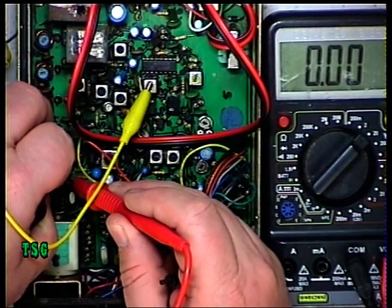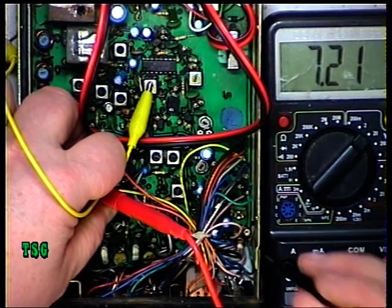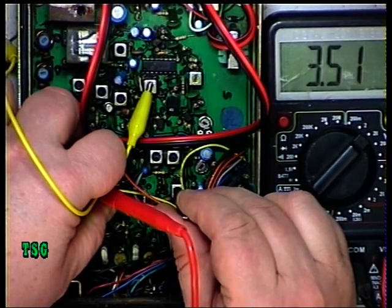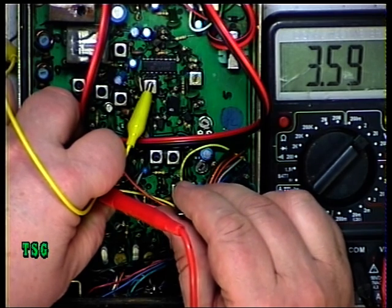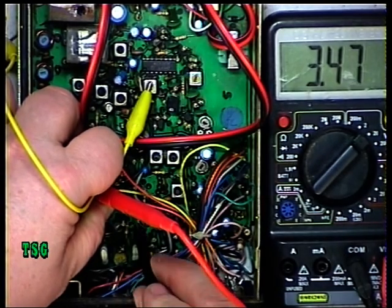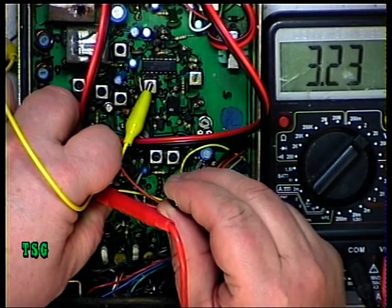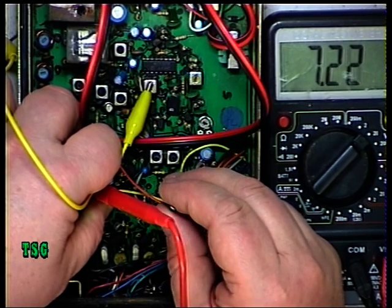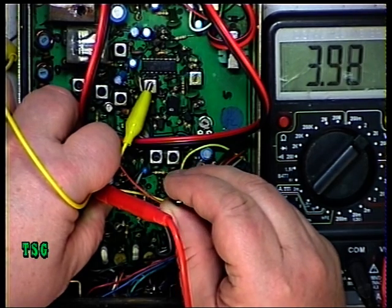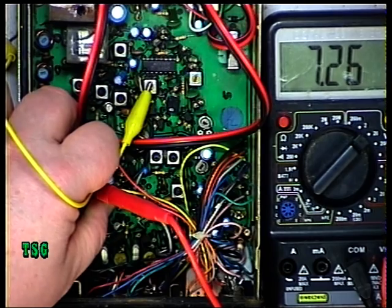When I looked at the monitor in transmit I had 7.2 volts — a logic high. Now if I adjust the VCO inwards, it's now out of lock: there's no transmit, we've got three and a half volts, and you can hear the transmit-receive relay clunk out — it's controlled by the 4011 gate chip. So we go until we get into lock, and go the other way and we're out of lock again — the relay chattering. Then back into lock.